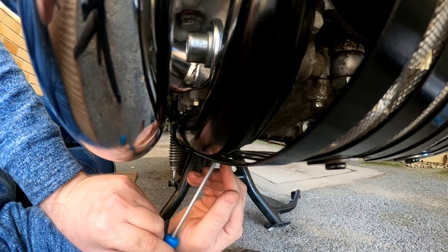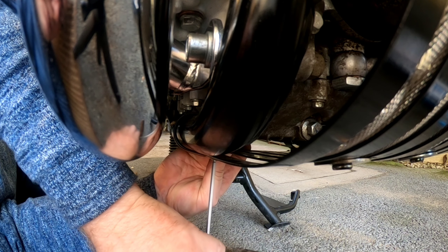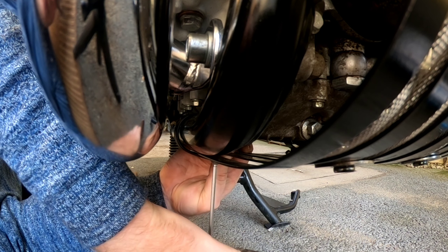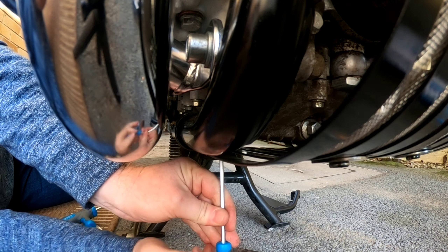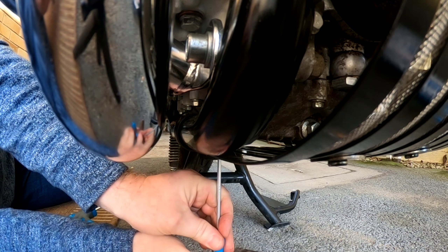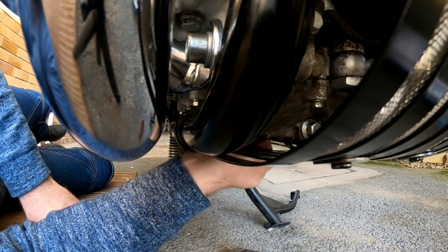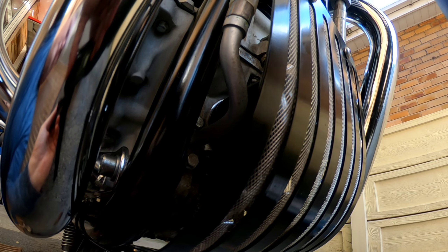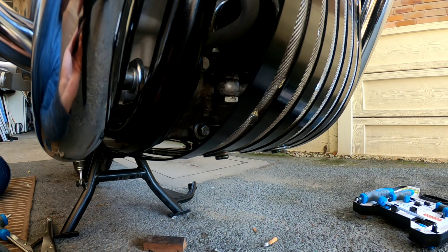Once you've got your clamps hooked over the frame, always make sure that the locating nut is on the inside. What you need here is a few extra hands because getting them lined up can be a bit of a faff, so just have a few trial runs. Once you get the first couple of threads in you're away — it's just a case of tightening it up until it clamps. Don't tighten it all the way down yet because you've got to centre it all and make sure you're happy with it before tightening all the screws properly. It can be a bit of a faff to get them lined up first time.